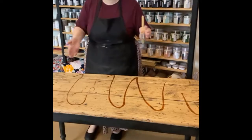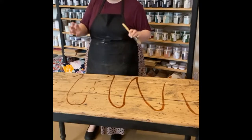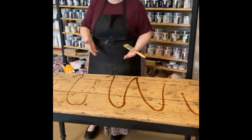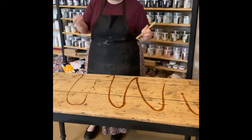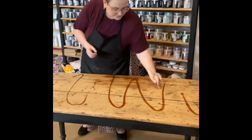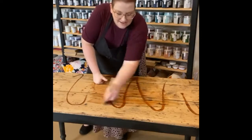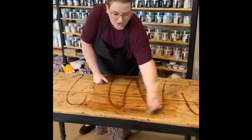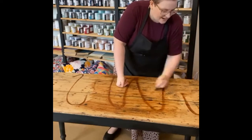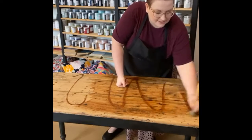You don't want to put heaps on because what's going to happen is if you can't get that off, you're going to end up with a really sticky, yucky, hard to remove mess. You can see where those lines are — they'll go away. It's just because the timber's so thirsty and it has drunk all of that in straight away, which is fine. They'll all go away as it does its thing.